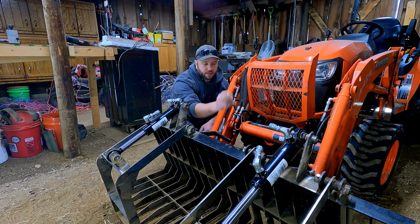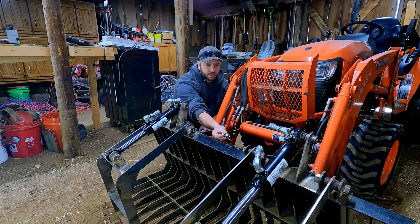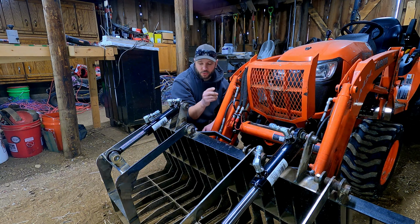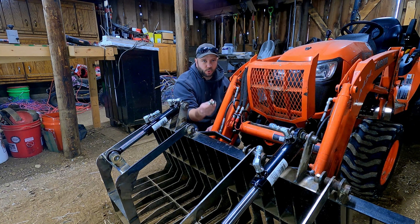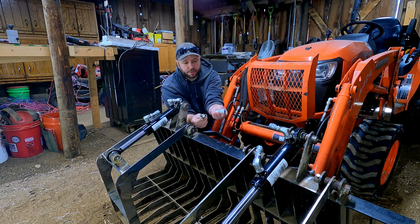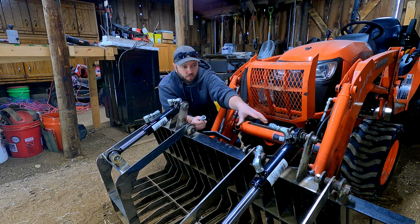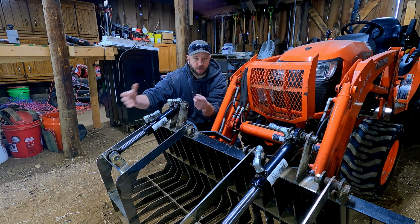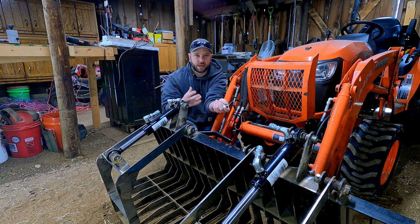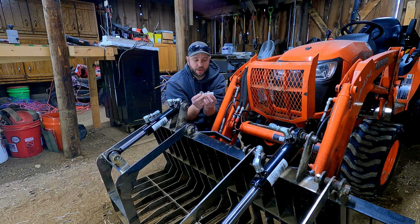So now to be able to run both arms off of one hookup point, I'm gonna have to put a T in between for both sides of the hydraulic cylinder. And the whole point of doing the arms and pins the way I did was to be able to make these arms easily removable. So I'm gonna install some quick connects on the T's in order to be able to disconnect, remove one arm, and then have the rest of the hoses come off with the other arm, so I'm not fighting all these hoses or having to take hydraulic lines apart to take the 2 arms off the bucket. So let's head over to the workbench, make up a couple T's.